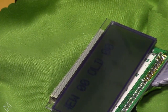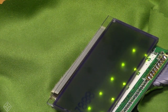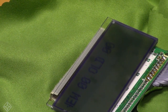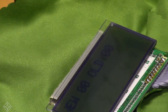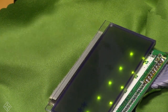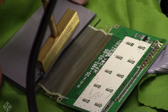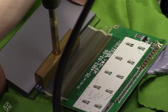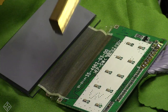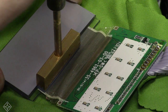There's no way of knowing if the process is working until you power the phone on and look at the screen again. So I'm going to plug the base back in, making sure I'm not touching any electronic components in there in the meantime, and we can see that there is already a drastic improvement. The screen is once again readable, and in fact it's almost 100%. So I'll unplug it and use the T-tip again, this time on the LCD side of the ribbon connection, in case there are any bad traces there. Just keep using it on both sides until the screen is fully repaired.